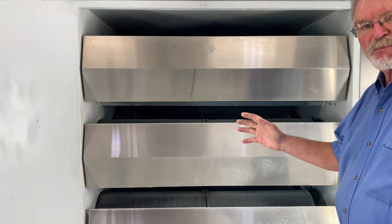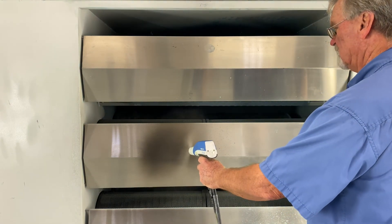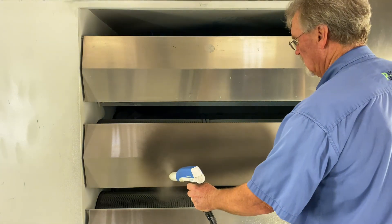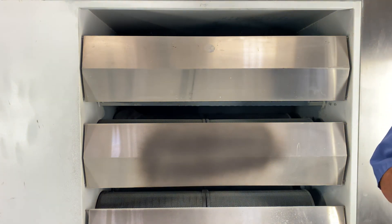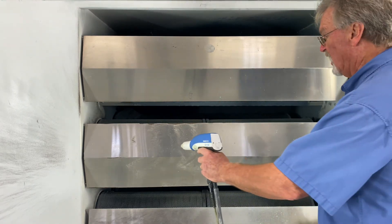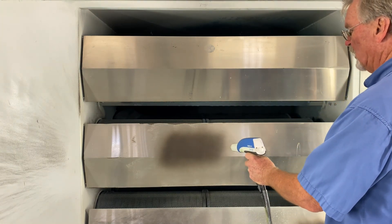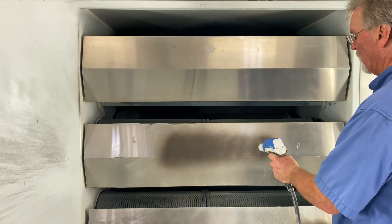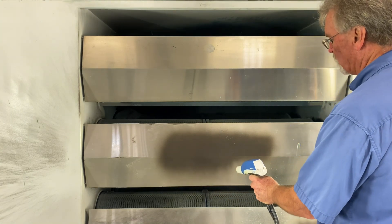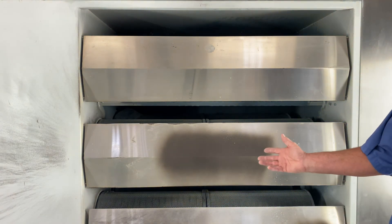Let me show you how much powder we lay down at the 0.3 setting. Now we're going to set it down to 0.1. At 0.1 on the FM, which is a relatively low setting as you saw, we're going to go ahead and apply powder now. You can see we're depositing less, but you don't see a lot of powder blowing by. As long as you can afford a little bit of time, you can get really high transfer efficiency at 0.1. Now I'll clean it off and we'll show you 0.2.